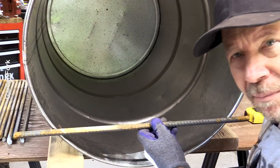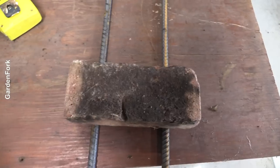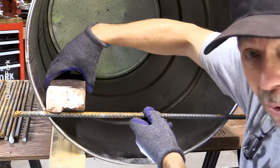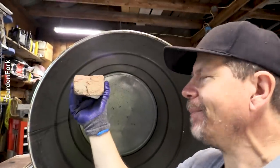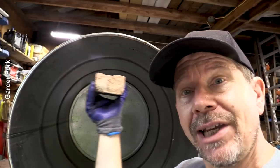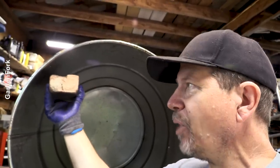This rebar — maybe the bottom quarter, bottom third of the barrel here — and for every brick, there are two pieces of rebar going through the barrel. So across here will be the floor of the pizza oven. And then the top — because it's important to have brick in the top — it absorbs heat from the wood fire and then radiates it back down to your pizza. We'll go across here, and that'll be held up; the rebar will be underneath. It'll form like a grid of rebar.